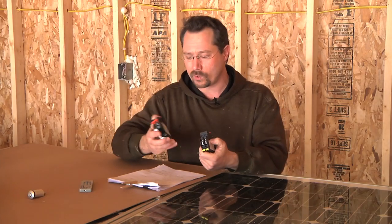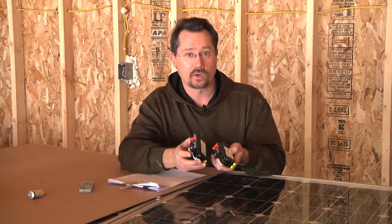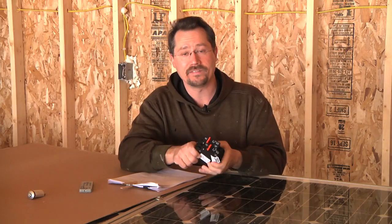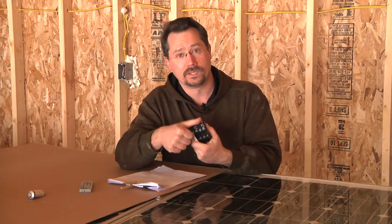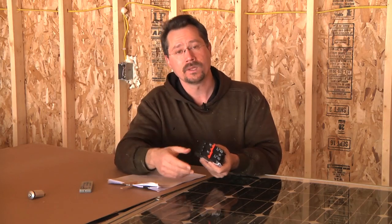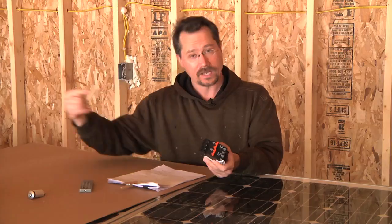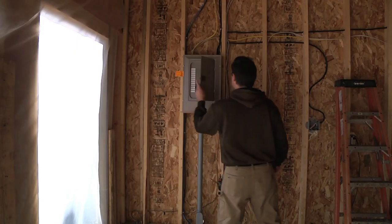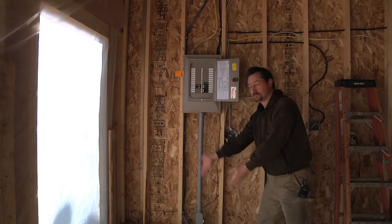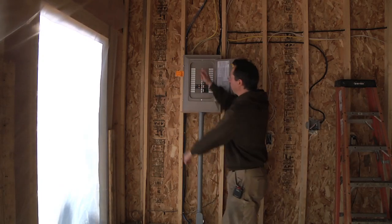I have the breakers for it — these are double-pole double-throw 20 amp circuit breakers that go inside the box, and the actual red handle on the outside literally throws the circuit breakers themselves to disconnect power. From that disconnect box, power comes through inside conduit right through the wall of the garage into my main breaker box, coming in through a 30 amp double-pole double-throw breaker.